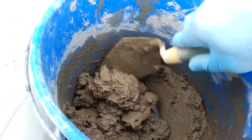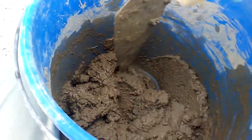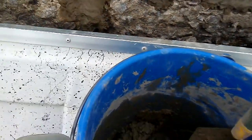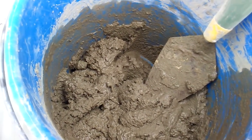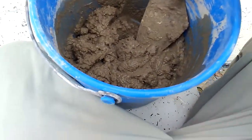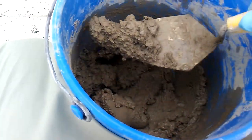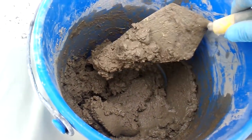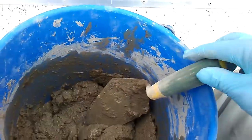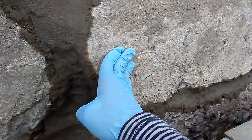What I do is really push it into the cracks as far as I can — you can do that with your hands, just wear gloves. Get your sand-cement mixture, add water slowly, and get a nice thick peanut-butter-like consistency. If the cracks are very deep and narrow, keep it a little more liquid so that it flows in.